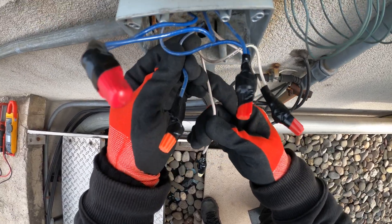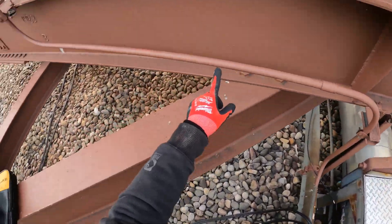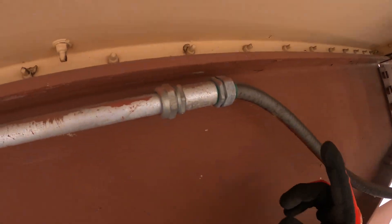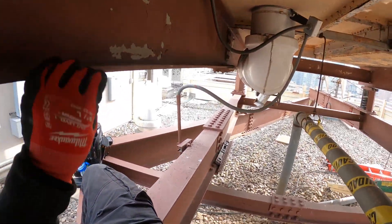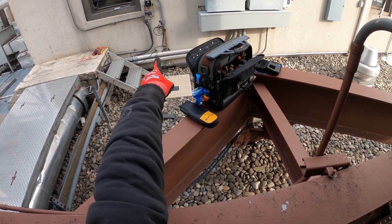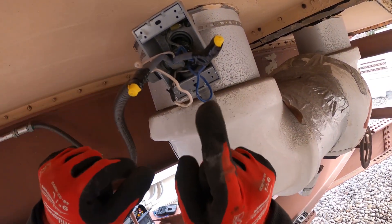These are the two wires that are disconnected. Sometimes you just want to look right at the edges — you might see exposed electrical and it could be a short. I'm going to travel this conduit. We come in right here, then it actually comes around here. Then there's another box and here's another heat trace. So let's open up these covers and see what's going on.